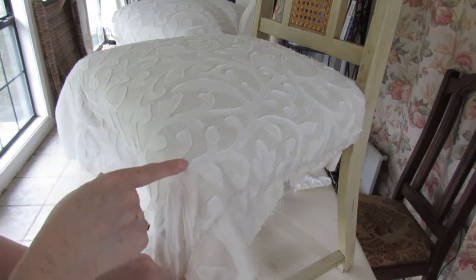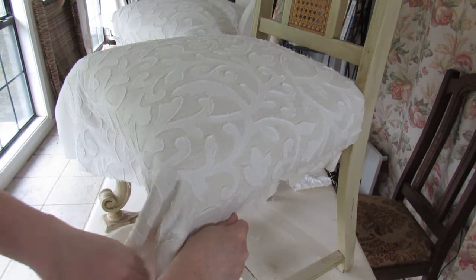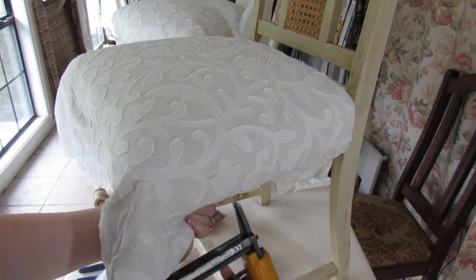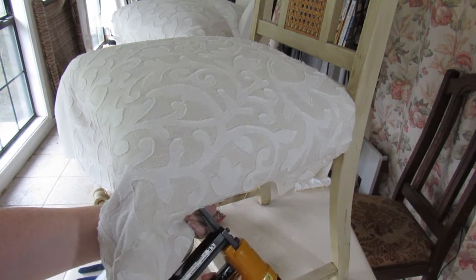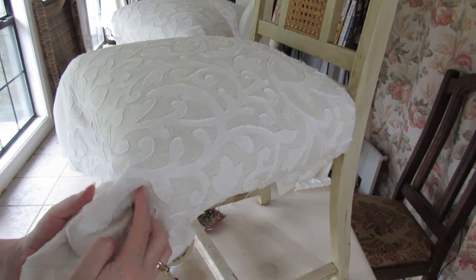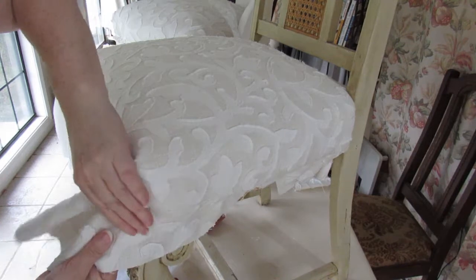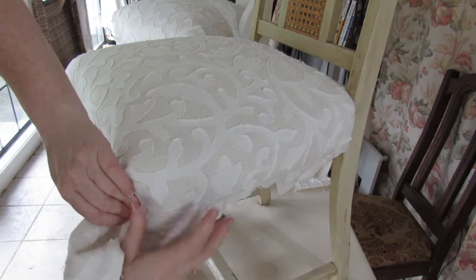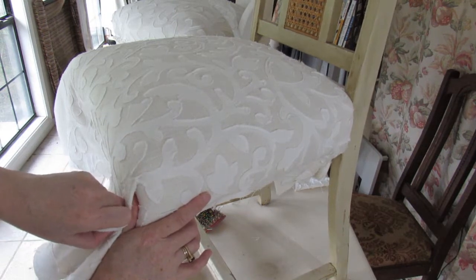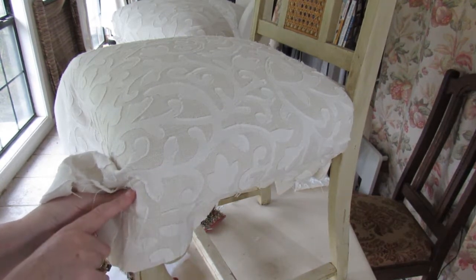With the chair, we're going to be pulling down towards the chair leg as we're going to come across. So we pull it down and across, and we're going to staple all of this part underneath with our hands. Just mind your fingers. Right underneath, like that. This is still pulling down. We're going to pull the fabric across the front, but over the Dacron so it's smoothed out. And we are going to pull this forward and down and around the front like that. And before we secure it, we're going to make sure that if we pull this down on the weft thread that it goes in smoothly, and it will. So I'm just going to pop a staple in here so it's out of the way.